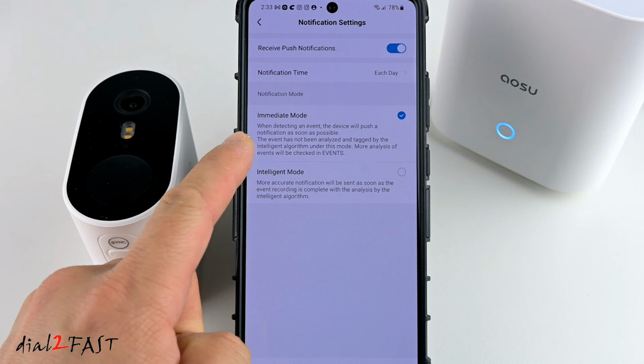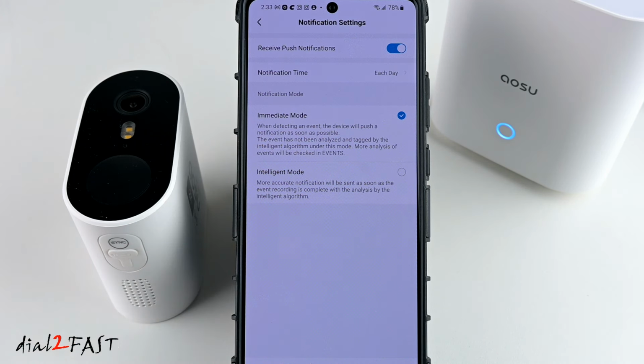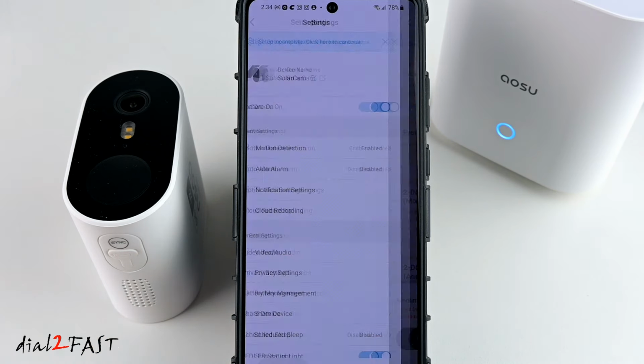Now you have 2 settings here, immediate mode or intelligent mode. With immediate mode, if it detects any motion, you will get a push notification. If you set it to intelligent mode, the camera will analyze the motion before sending out any notification. Cloud recording. You do have the option to do a 7-day trial or subscribe to cloud recording.